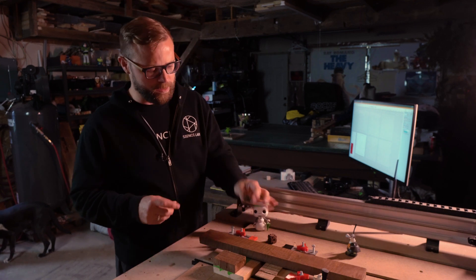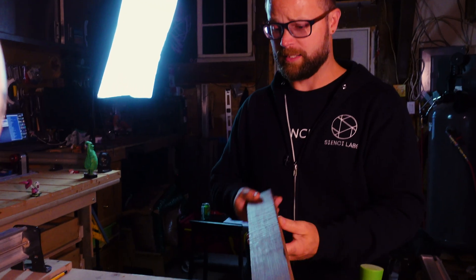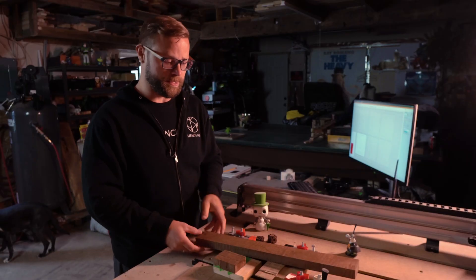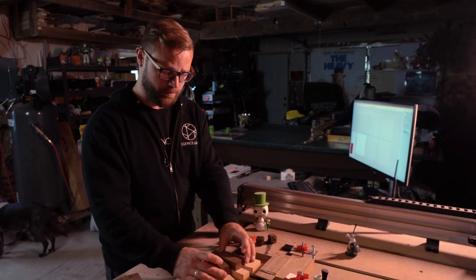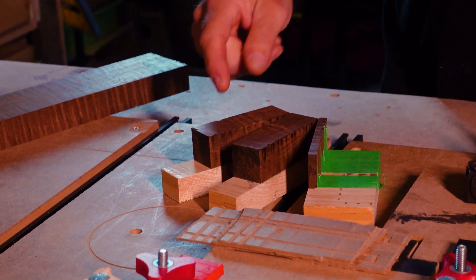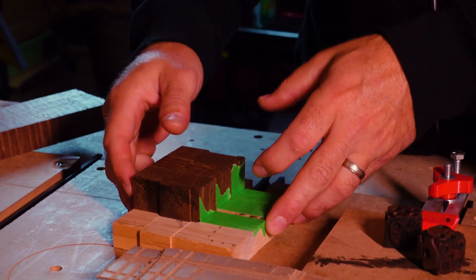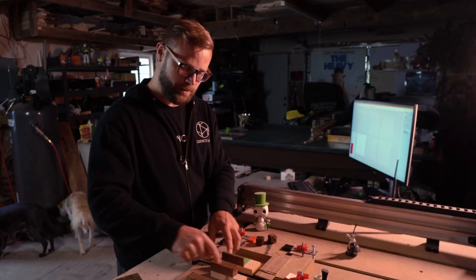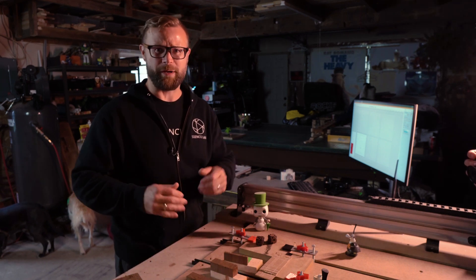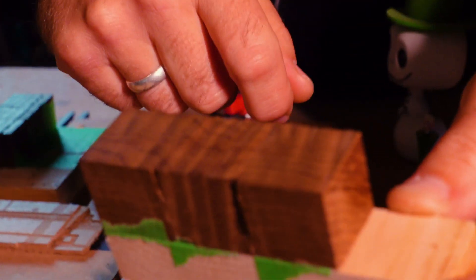For my dice, I wanted them to be one-inch by one-inch cubes. So to break down this lovely piece of curly maple, I ran over to the table saw and cut it in one-inch sections — it's already one-inch thick, so the only thing left was to cut it into smaller chunks. I did not just go in and try to cut one-inch cubes freehand on the table saw — that would be dangerous. So I used a little bit of CA glue, taped it to a bigger piece of wood, and then ran it through the table saw to cut my one-inch cubes safely, keeping my fingers away from the saw blade.